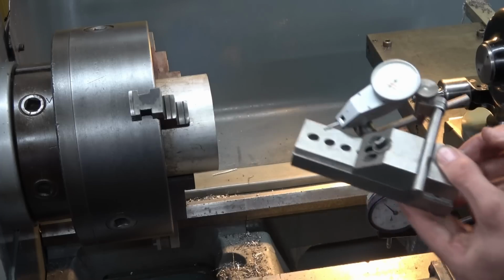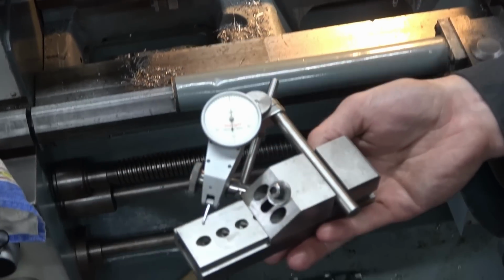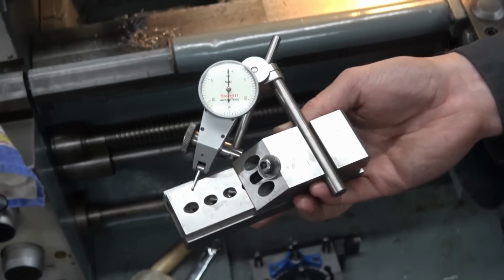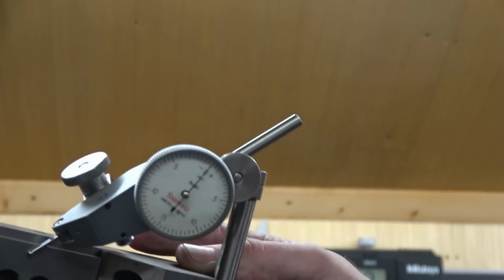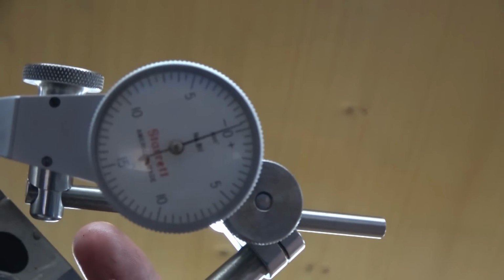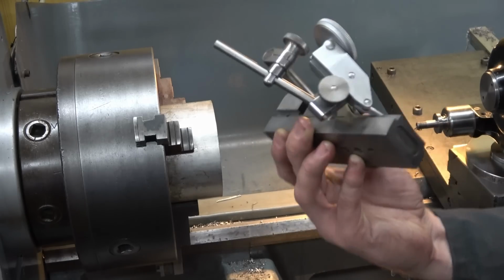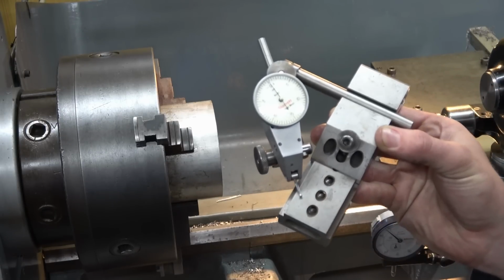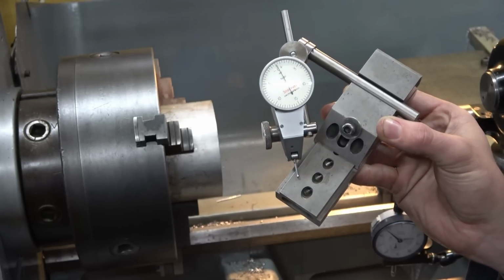Now let's repeat the experiment. Here, in its current setup, as held exactly-ish horizontal, I have a reading of 0. Now let's go up to the ceiling. That is a reading of just under half a thou. So this is the setup pretty much with the same overhang as I was using, and as you can see it's a totally different animal to the drop clock on the Noga base. That was point 1. To illustrate point 2, let's have a look at the actual setup I was using.